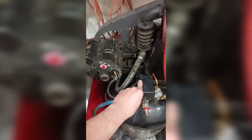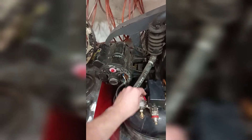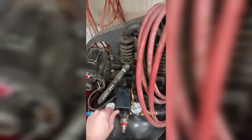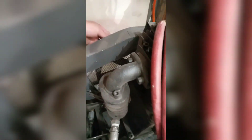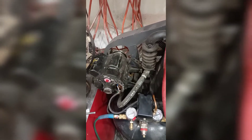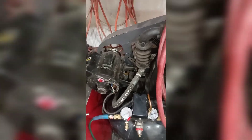This is unloaded. I took the belt off so it's not turning the compressor. This is what the motor sounds like. And this is how easy the compressor is turning right now. But when these two are hooked together, the motor just kind of hops and skips. So I think the motor might be toast.